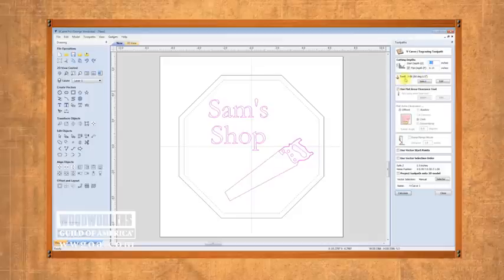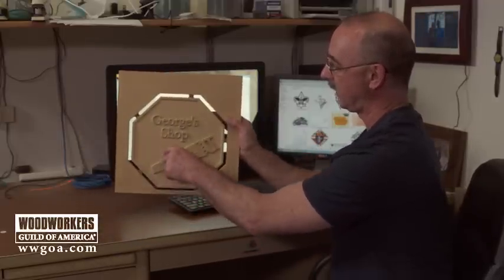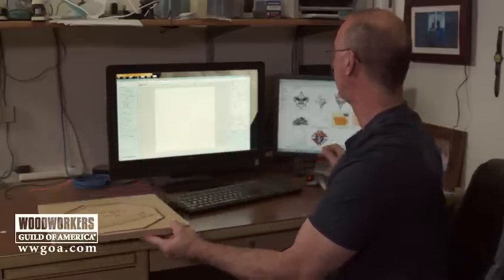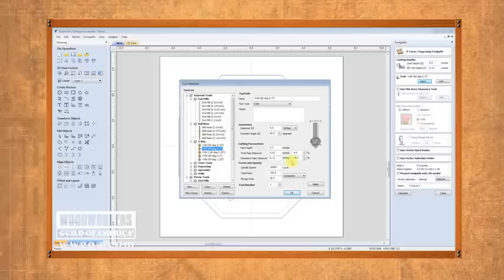Now, a couple things going on here. We need to pick cutters. For the V bit here, that's the cutter that we're choosing to use that's going to finish the cut. That's the cutter that will be right up against these edges and create that nice, crisp corner. And I find that a 60-degree cutter works pretty well for that. But if we look at our menu, when we select bits, we can use a variety of different V-bits in order to make that work, but the steepness of a 60-degree cutter works great for leaving good detail behind. Oops, because I didn't hit a bit when I was in here. 60-degree, half-inch diameter. There we go.